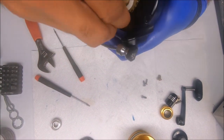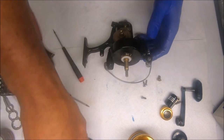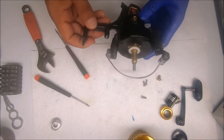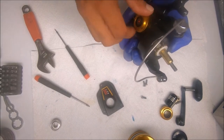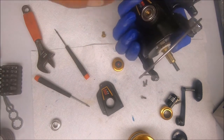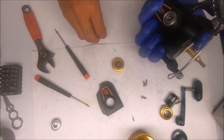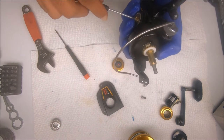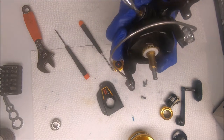Stick on the thrust washer now — just kind of play with it — then get the housing and stick it on top. Before I do that, I'll go ahead and remove this, add the set screw, and add some grease there as well — same thing happens with saltwater intrusion. Screw that in place, making sure the teeth are engaged — not sitting on top of each other but sitting inside of each other — before I lock this down.